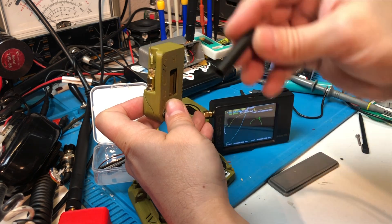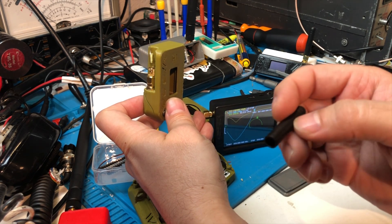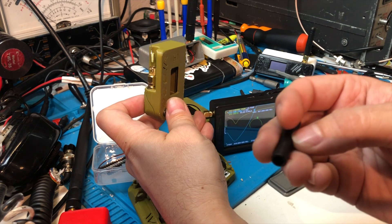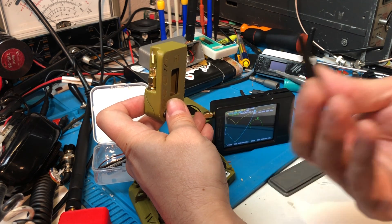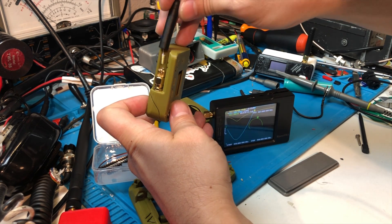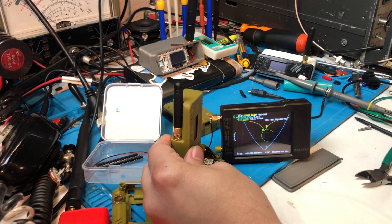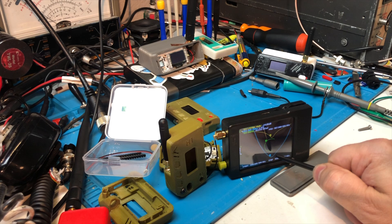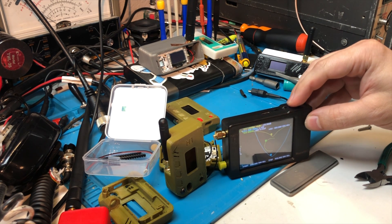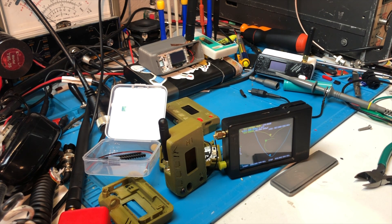If I take the plastic off, it comes back within frame — it's moving to the left. The reason that's happening is that to make this black, it's doped with a ferrous material. There's some actual conductance effect — to get this black, it is not transparent to RF. So we just have to account for it in our measurements. After snipping, we're resonant, probably closer to 908 or 910. There's 907 and we're at 1.12 — so 1.1 SWR, which is way better than where it was before. It was almost unusable before we tuned it.